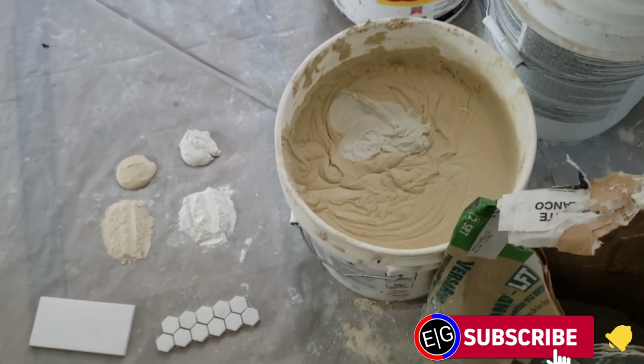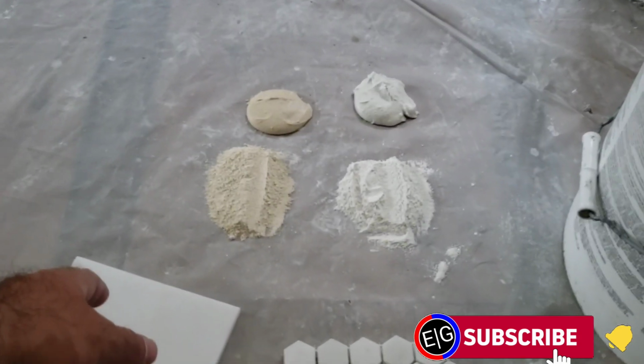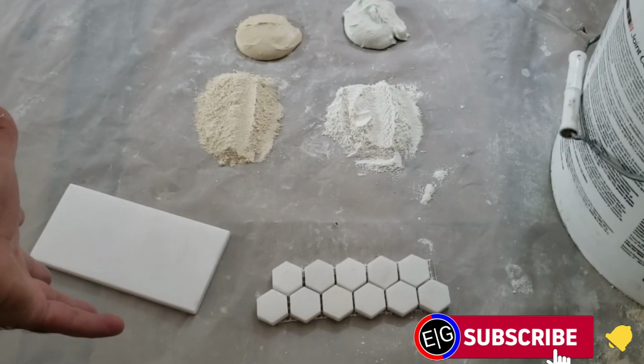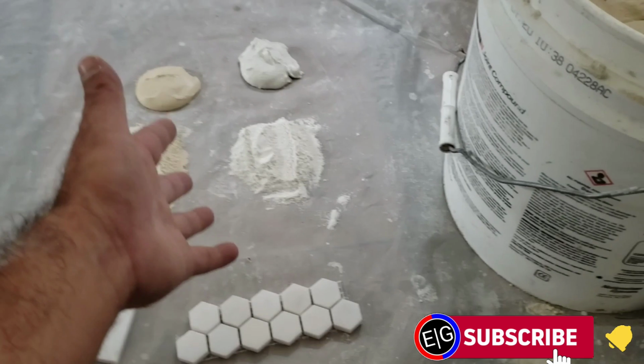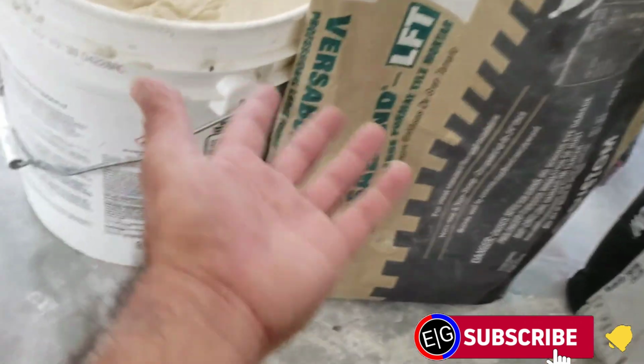Versabond, it's not white. Yes guys, for the ones that don't know, the white marble needs to be with white Thinset. This Versabond right here isn't white. Why? I don't know. It should be white. So luckily the LFT, at least that one's white.